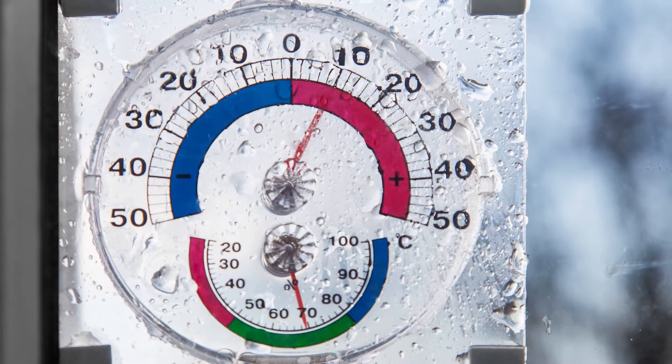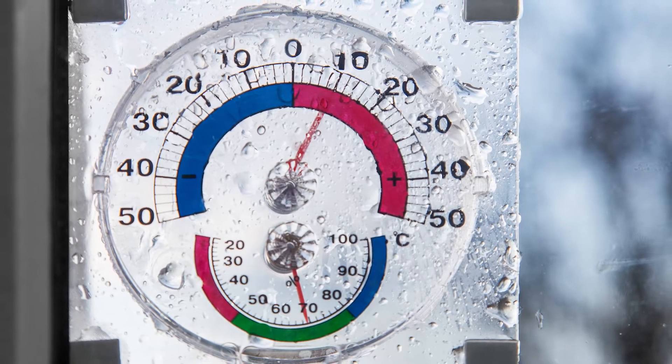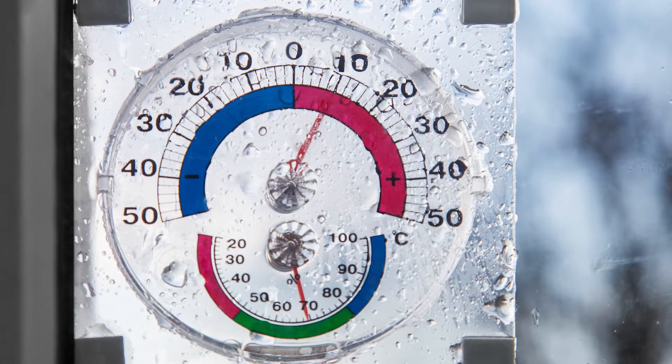With a new home, you're going to have excess moisture because of all the building components and the materials that went into that home. So as you turn on the heat in the colder weather, the moisture starts to come out of those materials and becomes airborne. You can monitor your levels by the use of a hygrometer — essentially weather stations. Most of those have a percentage for the moisture content in the home, and that's essentially what a hygrometer is.